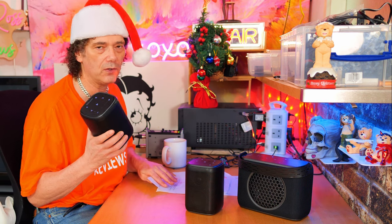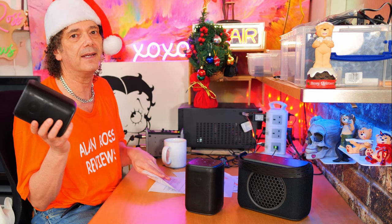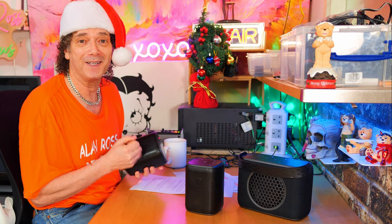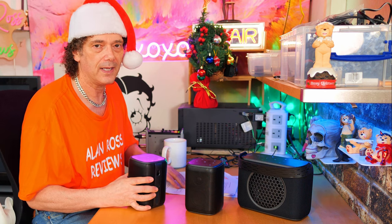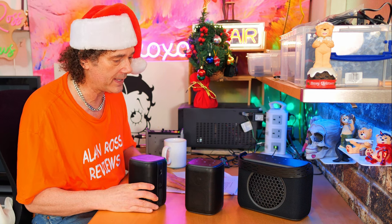And you could argue the way frequency response measurements are done technically are not completely in line with what you hear. If it was ported, you'd stick the actual measurement mic right up the port. Don't do that with your ears. And you've got to remember, mics are not ears. Even measurement mics don't measure in exactly the same way as you hear. So I put that out there.